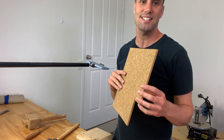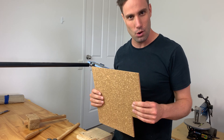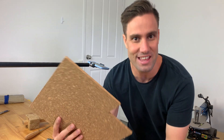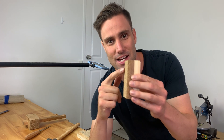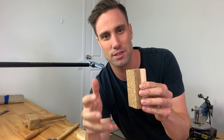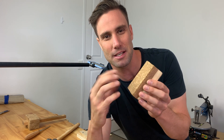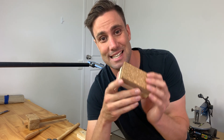This is cork flooring. Why would somebody want cork flooring? Each to their own, but it's great for sanding blocks. The bottom section here needs to make sure it isn't going to come through and damage or scratch your timber. So we put something softer on, and we've got some of this nice cork flooring — it is six mil in thickness, which means it's an appropriate amount.